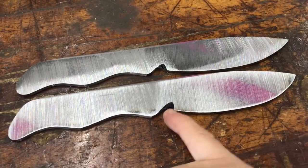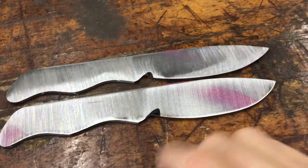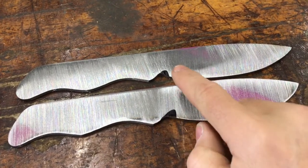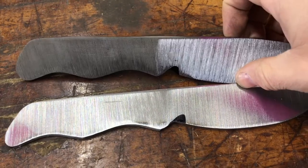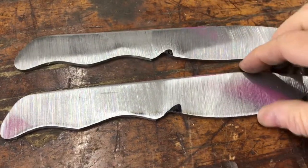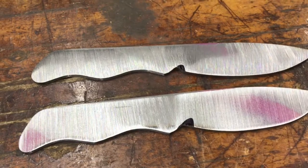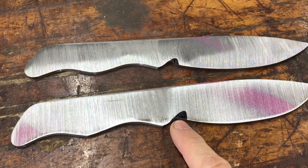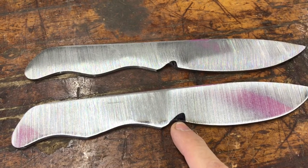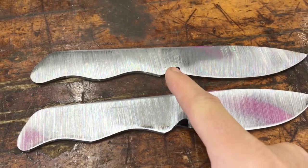The profile is set. Now we're gonna cut out right here — you can see where I've just used a little bit of Sharpie to give me the idea of what I'm trying to do. I'll round those out just a little bit better with a file. I use a cutoff wheel on a four-inch grinder initially just to get the bulk of that material out of there.